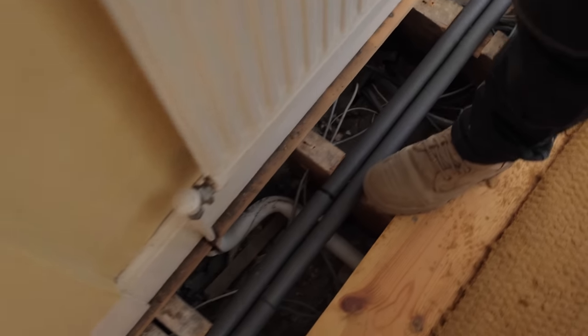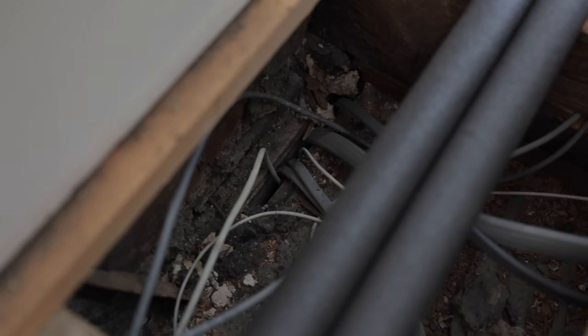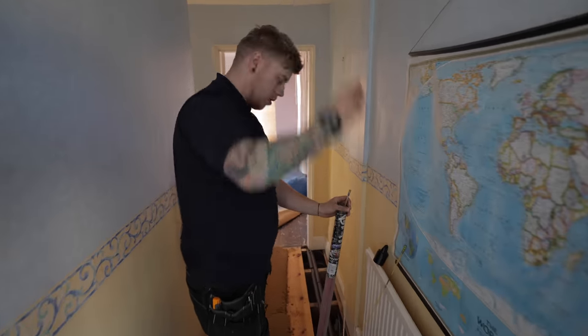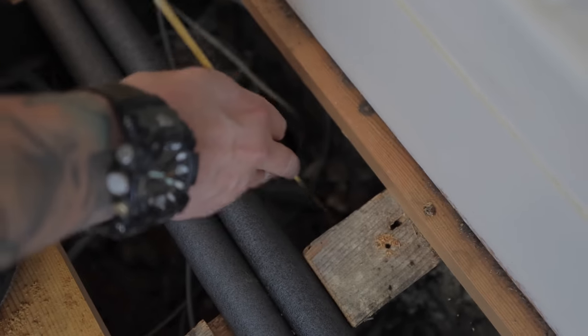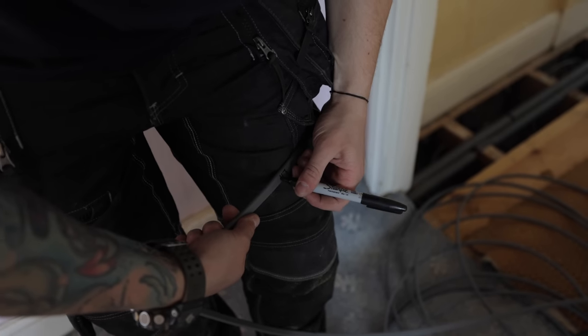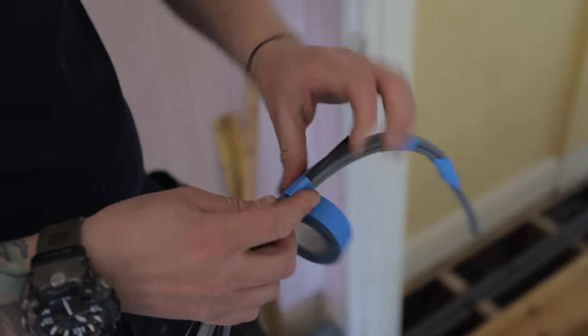Oh, that's interesting - I thought that was the board. Going down there. You can see where all the cables go down each side to the fuse board. There's a bit of a gap and it feels hollow downstairs. I'm going to get some rods out of the van, try a rod down to the fuse board, set the cable drums up here, pull the cables down to the fuse board, pull the cupboard back together, and get them to where they need to be.